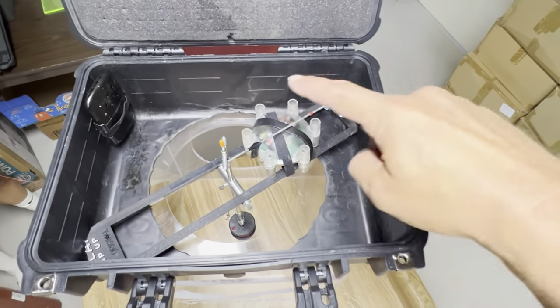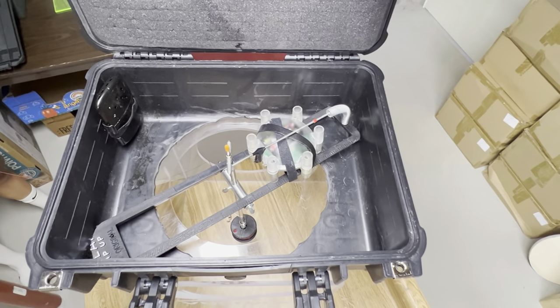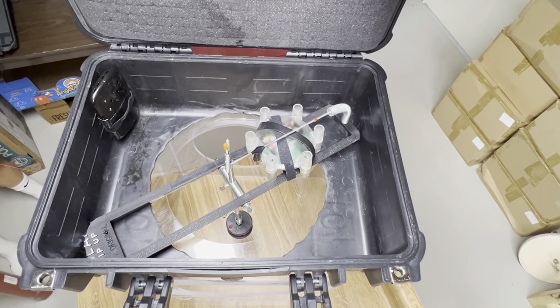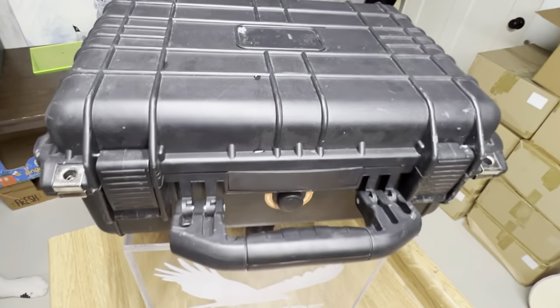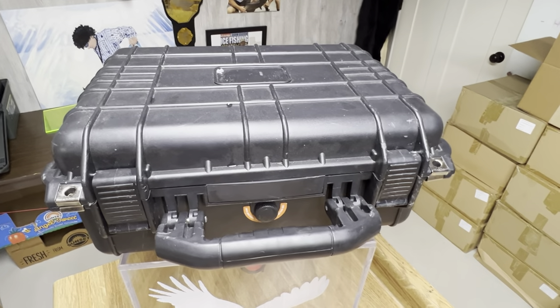You can see I modified the flag and cut it back a little bit — that's why this tip looks the way it does. I used the stronger magnet so I didn't have a line on there. When it closes up, it's nice and sealed. And when it goes off, the flag is short enough that it actually triggers.